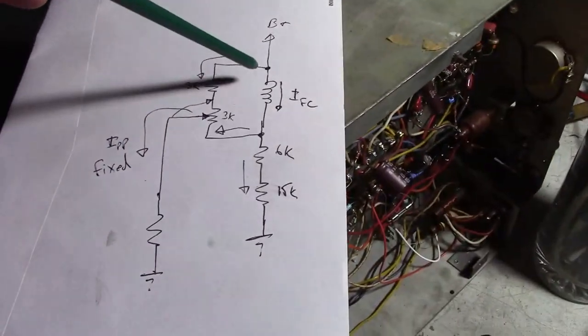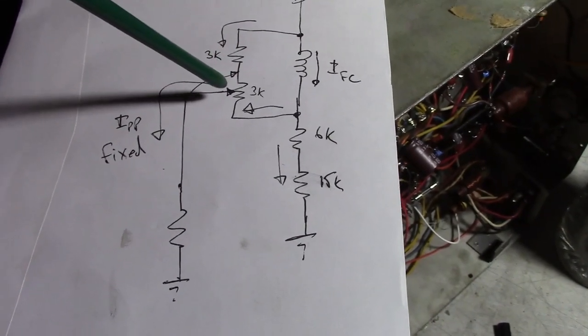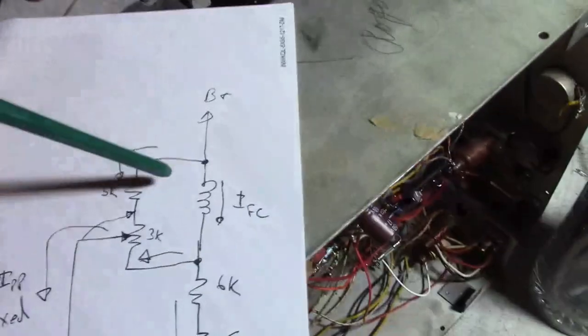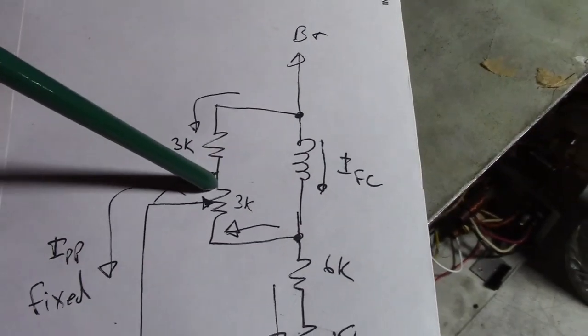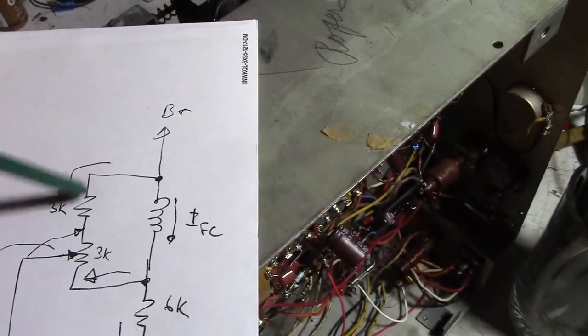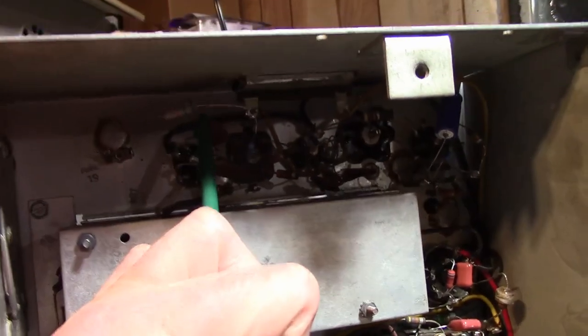What we're looking at here is the focus coil — that's the electromagnet. It's got two wires coming out of it. This is a 3k fixed power resistor, and that is a 3k wire-wound rheostat. There's a 3k fixed power resistor and the big guy is the focus rheostat. The 3k resistor and one side of the focus coil go directly to B+ right off the main power supply chassis. The other side of the 3k power resistor goes to one leg of the 3k rheostat; the other leg joins back up with the focus coil. So these two resistances are in parallel with the focus coil, then they join back up and go to two more power resistors to ground — that's the 6k and the 15k.